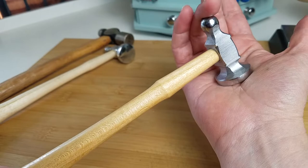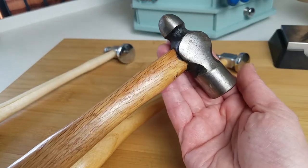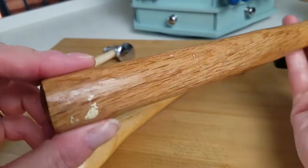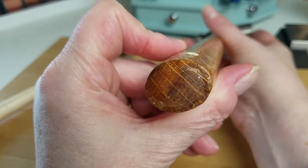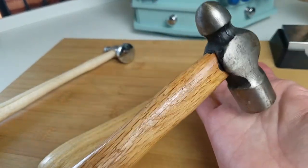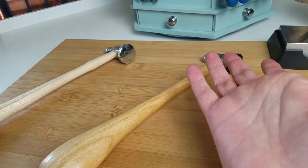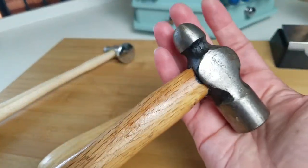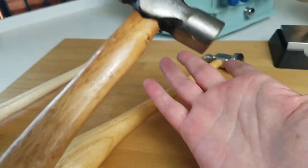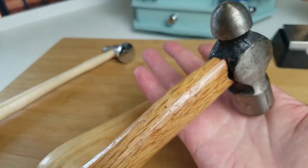Spring back is something used with a lot of hammers like this mechanical hammer or a carpentry hammer. Notice that the mechanical hammer handle is straight with no contour — and that design is important because this hammer is designed to have a lot of spring back. It makes contact with something and bounces right off, which amplifies the force. They're intended to drive parts — with a carpentry hammer, you are moving a nail, driving it into wood, and spring back really helps with that.